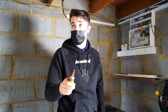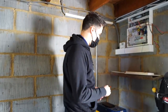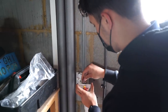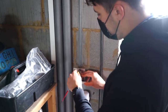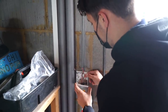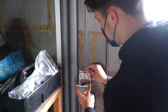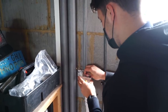So we're gonna wire it as two plate and then we're gonna run in a new two-way switch. So bear with. So basically I'm changing the switching. So rather than having the, this was wired up like so, and this was just coiled up in the back, obviously it wasn't stripped. Rather than have it like that to get the permanent feed through to there, what I'm going to do is instead, sorry, it was wired up that way actually. I'm going to disconnect the black cable from there.